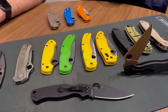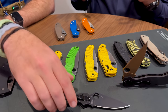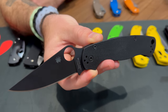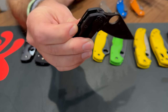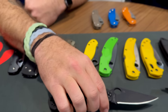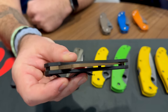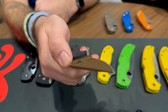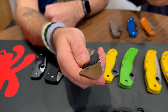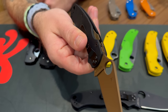This new coating brings the same wear resistance and same black color as DLC, but it doesn't heat the steel as much, giving you more options in steel grade without tempering it. It also has added lubricity — it seems to have as good lubricity as a satin polish or even better. Not quite on the market yet; we should be delivering our new coatings by summertime. You'll also notice the liners are FDE, so we can do liners, hardware — we're really opening up our coatings.